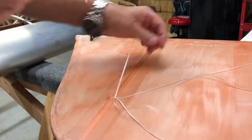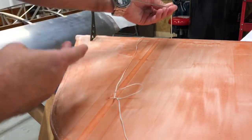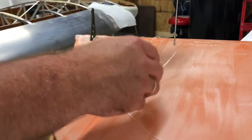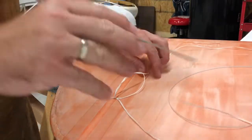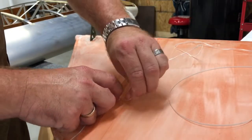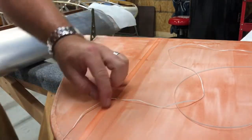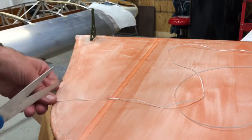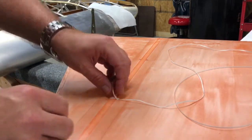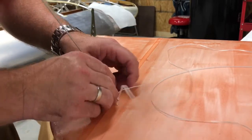Take your needle, come over and go under the belt, pull all of that long string forward, bring the needle back towards you, bust a U-turn, and go back through the tunnel. Pull the knot forward and over to the right — that's a double half hitch knot, two half hitches. Now that knot is done and it'll never untie. Leave a good inch to inch-and-a-half tail, then cut the rest off.